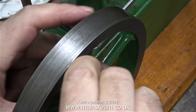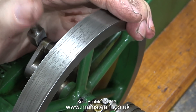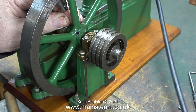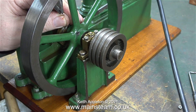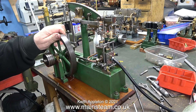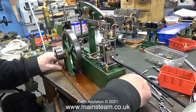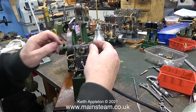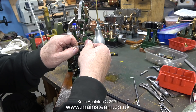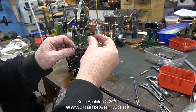Things like side play on crankshafts and side play on connecting rods generally will cause some mechanical noise. What I'm doing here is firmly tightening the grub screw in the eccentric using a pair of pliers. Once I readjusted the eccentric, I checked where the air was being admitted, and as you can see it's just before top dead centre — but it's still not right. I'm using the term top dead centre to describe when the piston in the cylinder is at its fullest extent in either direction.